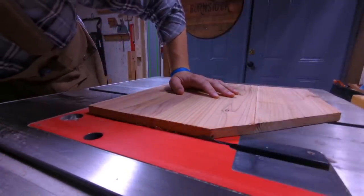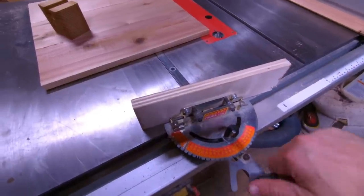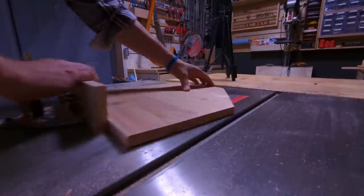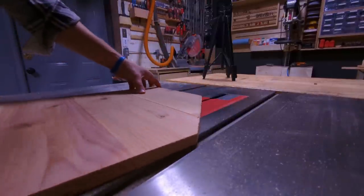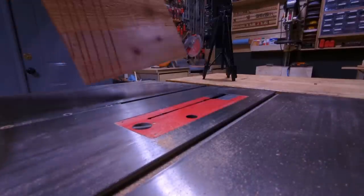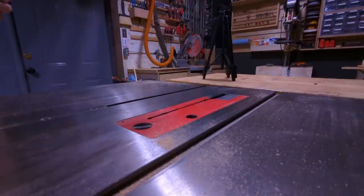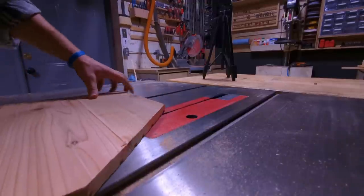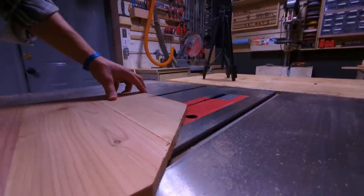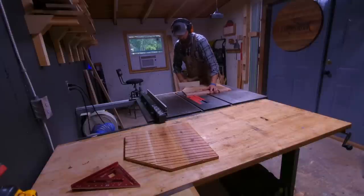So one thing I do need to talk about, even though this is kind of a quiet build part of the video, I'm cutting grooves that are the width of the saw blade. These are cut at 10 degree angles on the inside of each panel, and they're very random. This is so the bat has a foothold to climb up into the panel. The reason they're not cut straight is because baby bats will fall out of the house.